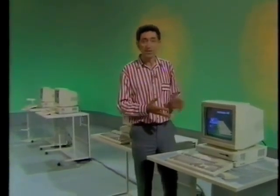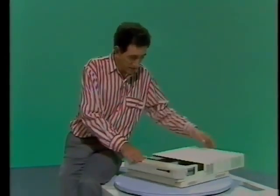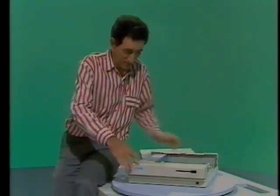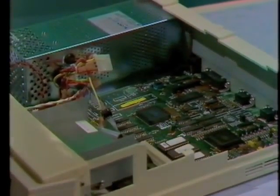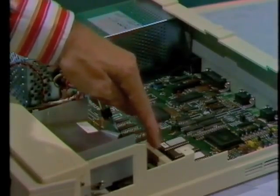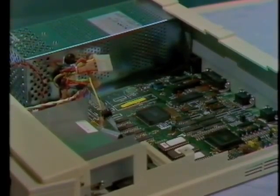So that's the range of machines which extends from the 305 up to the complexities of the 440. Now you know what to look for, let's get inside a real machine. I've already undone the five screws on the back and sides, and the lid simply slides off. It's a robust metal case. Here's that circuit board that we saw diagrammatically a few moments ago, viewed from the same angle. There's no backplane, but this is the socket for the half-width version. So it must be a 300 series — in fact, it's a 310.